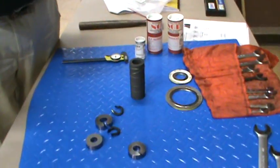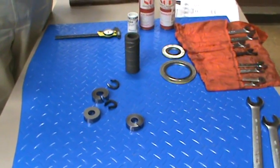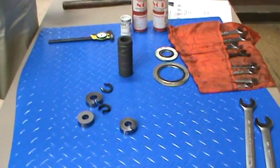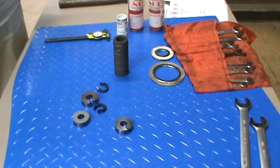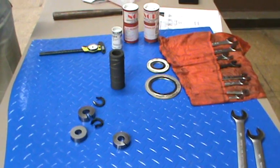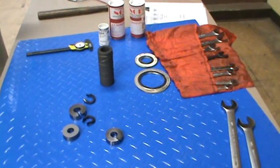Okay, and I'll just add one more piece of the puzzle here. To use a football metaphor, football is all about ball control, tackling. In the valve business, it's all about packing and gaskets. We can always live with a valve that's leaking by. We just can't live with a valve that's leaking out of the pipe into where the humans are. So packing and gaskets are primarily the easiest things to do, but have the most importance to what we do. So you always have to be very careful when packing a valve and making gasketed joints leak tight.